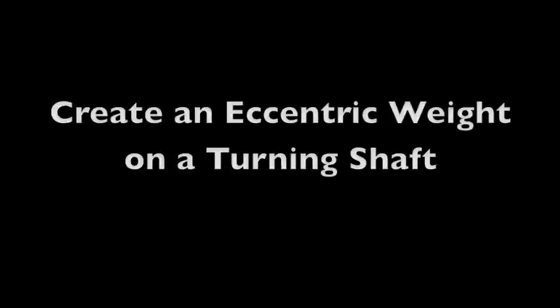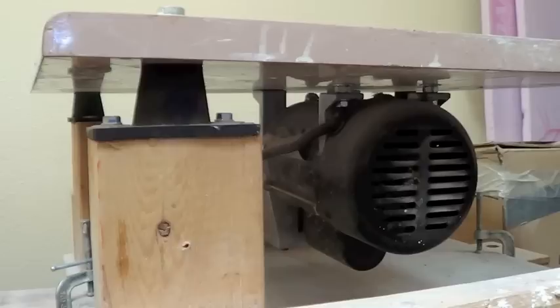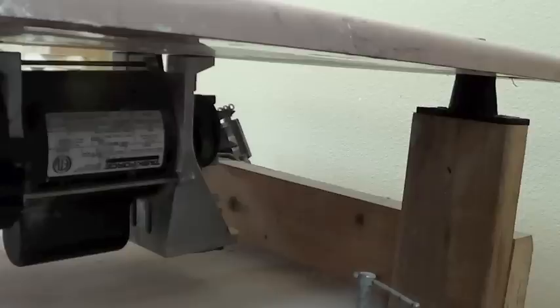Now, here's the big part. I built two of these shaker tables. For one, I got a half-horse motor from an old clothes dryer, drilled a hole in the pulley, and put a bolt and a number of nuts in the pulley to create an eccentric — that means you're creating an artificial vibration. For this one, I found a small compressor for sale cheap at a second-hand store. The compressor motor is directly attached to a piston. By bolting the motor with the piston hanging off one end to the bottom of the tabletop, I set up a really nice vibration. I did a more extensive instruction sheet years ago for an organization I worked for. Here's the link.